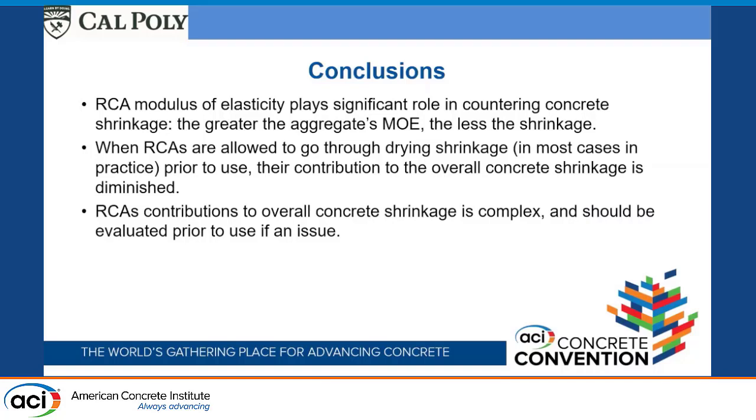Yes. But yeah. And then the curing, when you did the shrinkage, what's the process? Did you put it 6 days in water and then started the shrinkage, or? I'm trying to, again, that was one that I was scratching my head over just this morning. I was like, oh yeah, what was our process? Yeah. We do have a moist curing room, so it's in a moist curing room initially. And I can't remember if it was 7, 14, or 28 days that we did it first. Could that make a difference on your final? Yeah, we're following the ASTM on this, and I thought the ASTM was 14 days, but Okay. Yeah. Thank you.